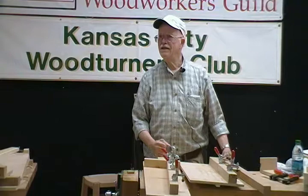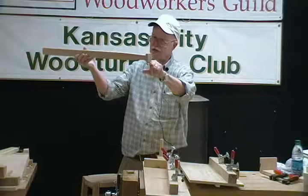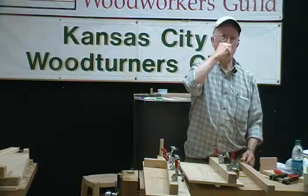Quick question: if you're cutting the outside off an eighth of an inch, why do you need the shim underneath? Because if the shim is not underneath, the previously cut portion protrudes up and tilts your board. You've already cut this space off here and you don't want to mess that up. Got it. And let me move forward because I'll show you the stop on this.